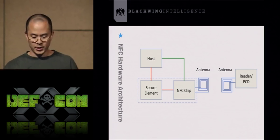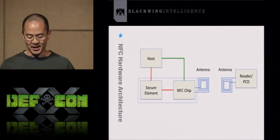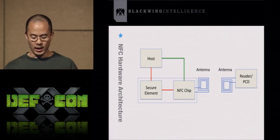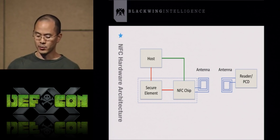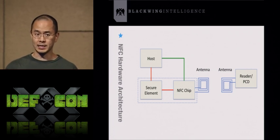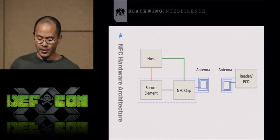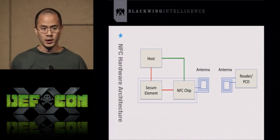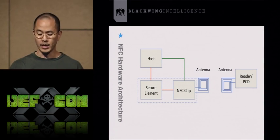Here's a picture of NFC architecture, at least conceptually. You have the host — basically the Android phone OS and hardware. The way Google Wallet works is it communicates with the secure element, which supposedly encrypts all your account information, and the secure element communicates directly with the credit card reader — the host never needs to see the credit card information. What Doug's code does is follow a different path, using the host controller interface to communicate directly with the NFC chip and the reader, allowing us to capture the entire byte-level transaction.